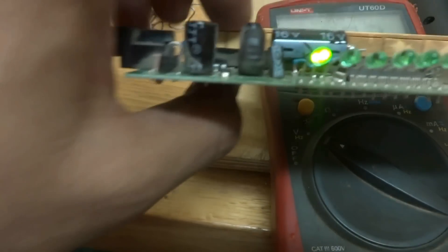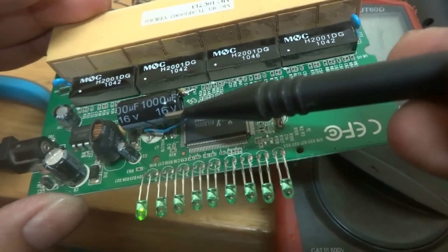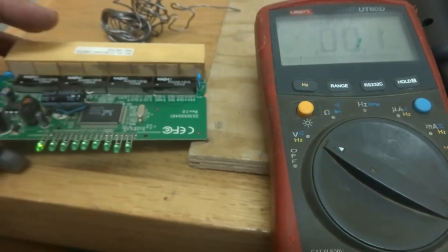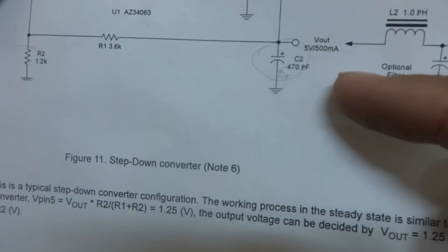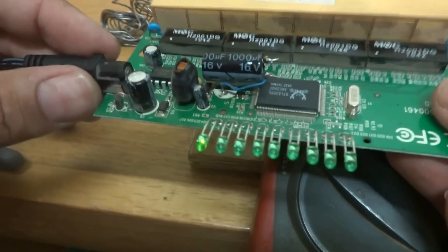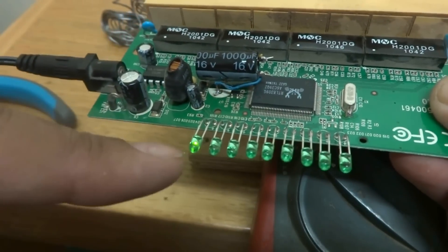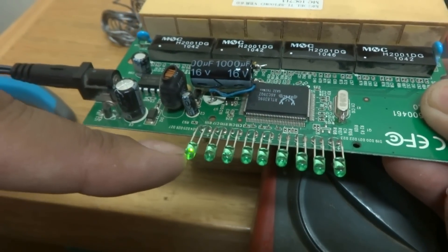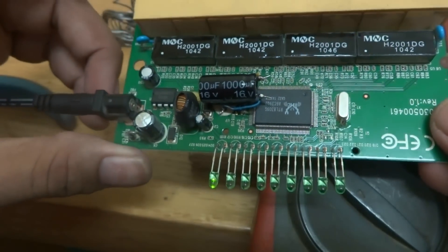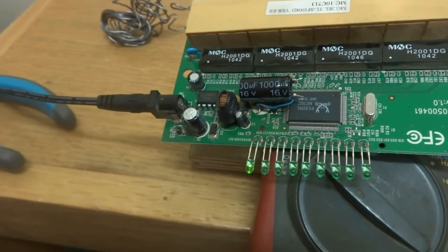As you can see, there is no more blinking. What it means is there should be 1.7 volts working on this - but as this capacitor was bad, it was not behaving properly, that is why we were getting erroneous indication. The datasheet was telling 5 volts but that diagram was not for this particular unit - they were only reference datasheets. The switch is now powered up, all LEDs came on once and then went off, and only the power LED remains. By this way I just repaired this switch and restored it to life - I will reuse it of course. Thank you for watching, keep watching, share, subscribe, and like if you are liking it.